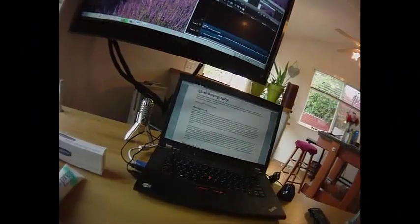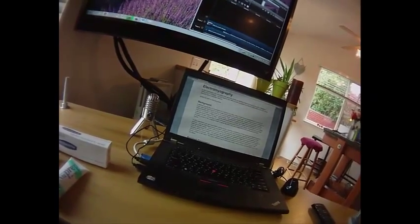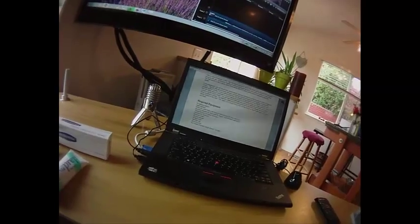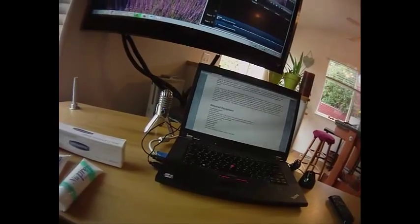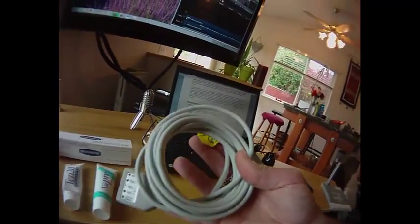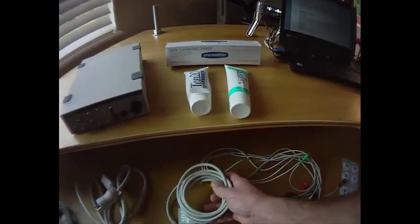This week we're doing a few different electromyography experiments, and we will have expected you to have read through the instructions before lab in the student protocol. There is a background on EMG, then we go over the required equipment. We will be using a computer system, the LabChart software, a PowerLab system, and then a five-lead shielded bio-amp cable. It has two different channels — channel one and channel two — and an earth or grounding lead.